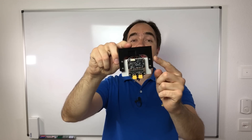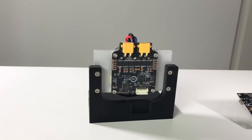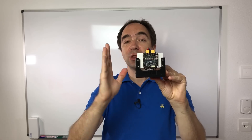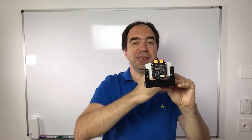When you don't have a space problem, it's perfect. What I really like is the solution used for actuators where they put the controller at the back of the motor — compact, small, and not many wires. This is one example: a controller from the company MJBOTS. They have a really nice YouTube channel. The motor is directly connected to the controller, the encoder is built in, and all you need to connect is two wires for power and two wires for CAN bus. When you have many controllers like this you just connect one after another through the entire robot arm.